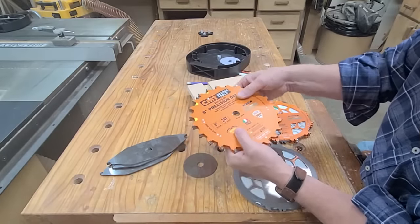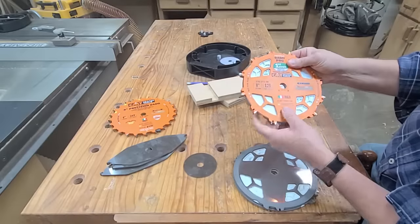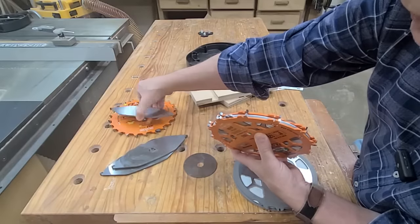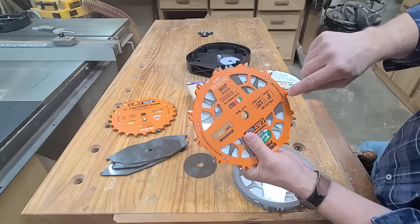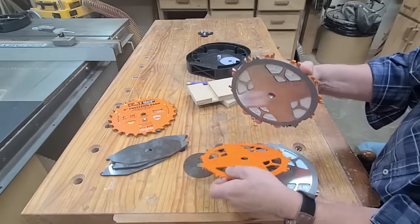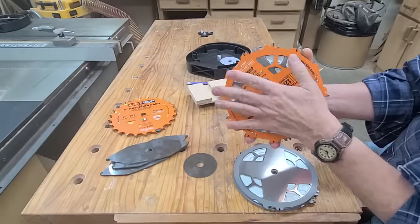Those are the reasons the EU has banned these blades. Interestingly, these CMT blades are now compliant in the EU and are allowed to be sold. CMT has figured out a way so this whole unit can be locked together so the chippers can't move independently of the outside blades. One way is that behind every tooth there's a little notch, just the right size to accept the tooth that sticks proud of the chipper. When you put this together, that tooth from the chipper sits right in that notch, so this cannot move.